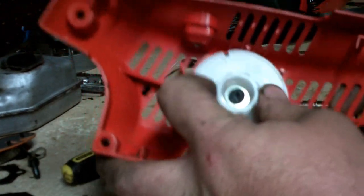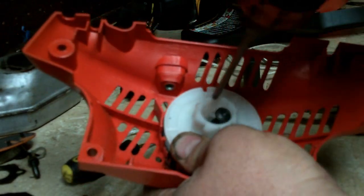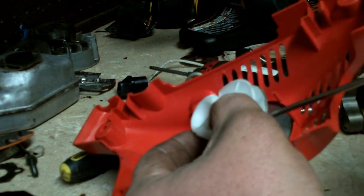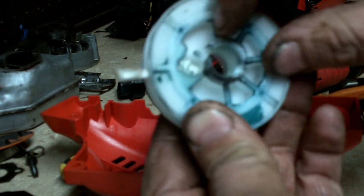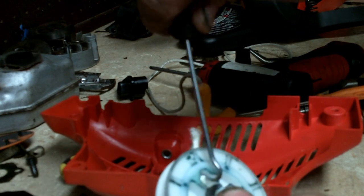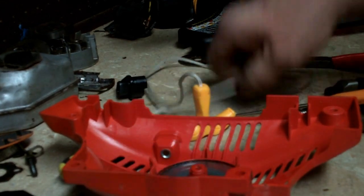Make sure there's no tension on the rope rotor, then remove the T20 torx screw that's holding it on. Carefully wiggle and jostle it — don't let the spring come out with the rope rotor. If it does, get a screwdriver and help push the spring back down in there. Remove the rope rotor and the screw. As you can tell, the reason we have to take this out is the rope is tied in a knot in the backside. Get a scratch awl or a pick and dig that rope out.